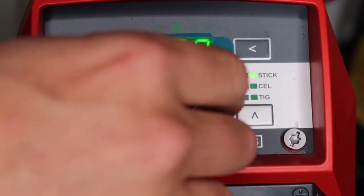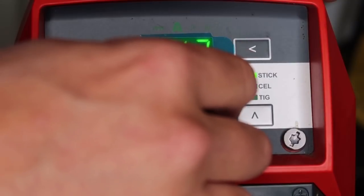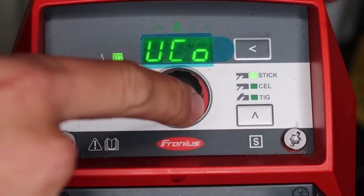I'm going to go into the machine and adjust the automatic voltage cutoff to about 45 volts. Push the button in, hit the bottom right cursor to get out to the main menu. I'm welding here and I'm going to pull back on the electrode — you can see the arc flare, it's a lot larger than at 30 volts. I'm going to continue welding, pull back again — you can see the arc flare, it didn't go out, and now it shuts off. So at 45 volts you can get a lot more arc flare or pull back on the electrode, which might be a good setting if you want to whip and pause.